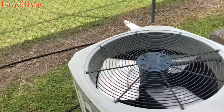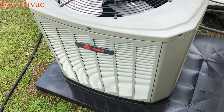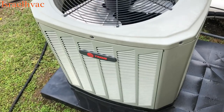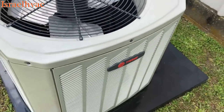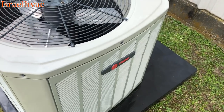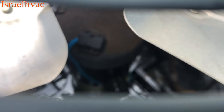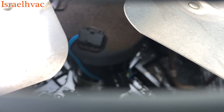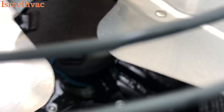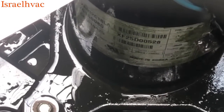Kill this disconnect right here, wait for the fan to stop, and you can clearly see this is a Trane. Your first telltale sign is right there — I don't know if that's an overload or what LG calls that — but those two blue wires, that's definitely an LG. And if you look down there — I can't zoom in because I'm using my phone — but that is an LG compressor, ladies and gentlemen.